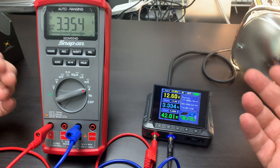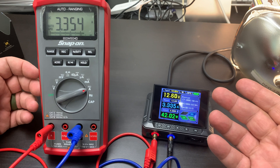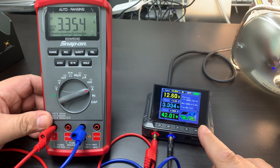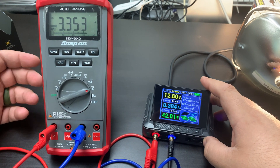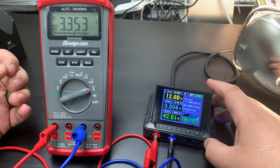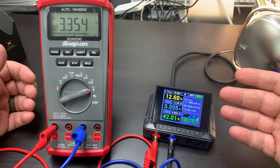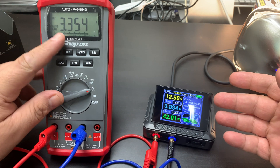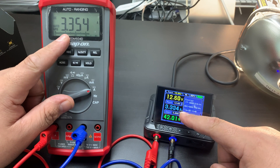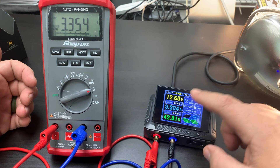And my meter is showing 3.353 amps. So it's slightly off on the amperage reading — it's nothing too crazy. I'm not seeing like a whole amp that we're missing here. It is slightly off, but again, when you start using any type of tool or apparatus like this — when you're going to use it in the shop or on a test — we always verify what it's putting out. So this way we make sure that we understand exactly what we're getting ourselves into. Since I do trust this meter, the reading I'm showing is going to be just slightly off — nothing too crazy, but it is something we can take into consideration.